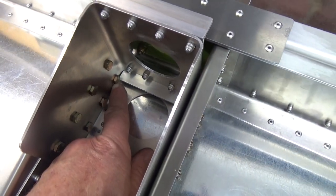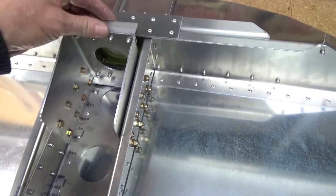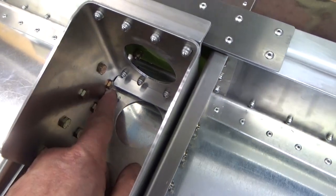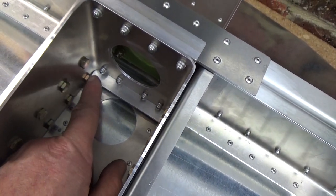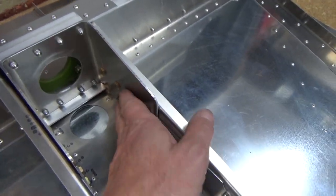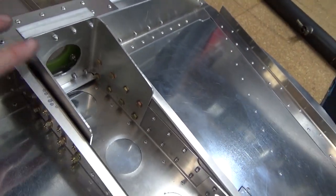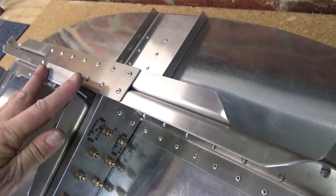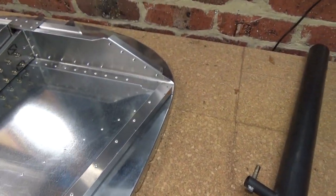The issue I had - there's a close fit. These bolts, which are on the outside, this is the new part for the nose wheel suspension. Just that bolt down in there comes in close contact here - might have it a bit too neat. I just ground the flat a tiny bit - which is a little bit more than a beeswilly - and same on this side. Got it all riveted in. This part is an aftermarket thing, but with Zenith I guess the kits grow and things change. Pretty happy. Got the firewall done - a lot of work there, a lot of rivets.